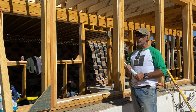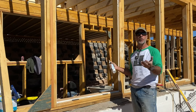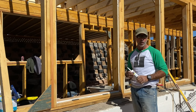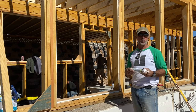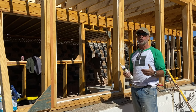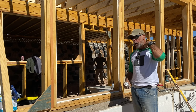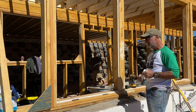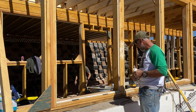And the other reason why your window might fog out is if you left it sitting out in the sun for, say, a few weeks before you were ready to install. The glass was delivered less than an hour ago, which is the reason why I'm standing here right now in preparation to install this piece of glass. I don't want the glue around the outside of the window to dry up in the sun, not even for a day. Because I know I'm going to take advantage of that warranty in 10 years, but I don't want to have to pull all this apart any sooner than necessary.